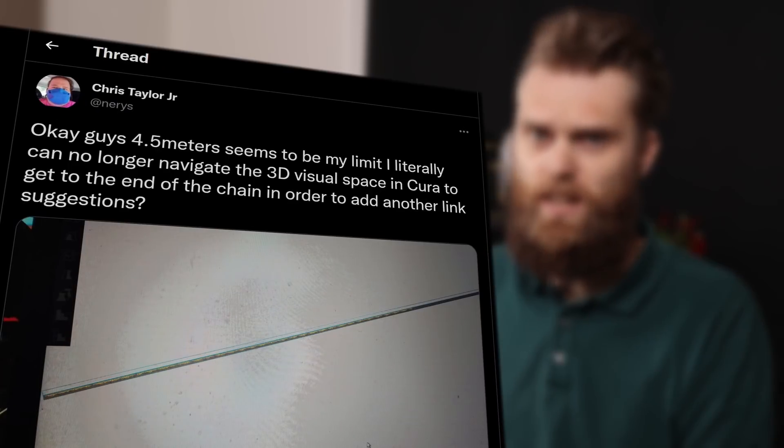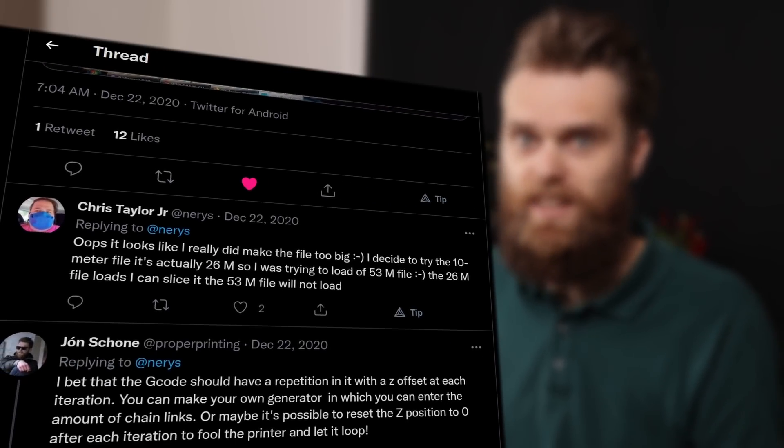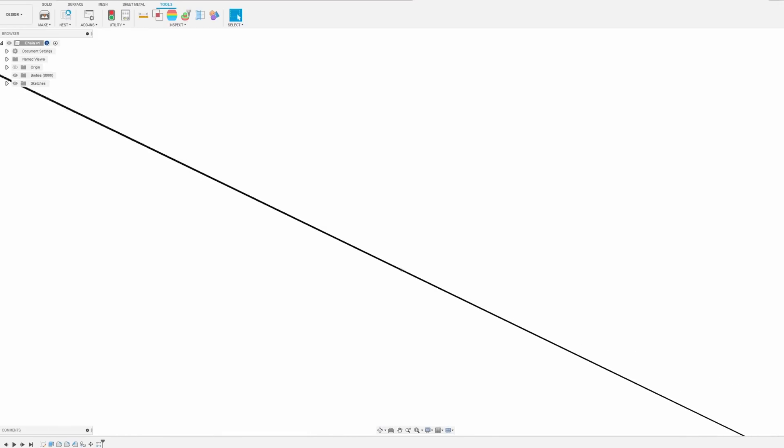On December 22nd, Chris Taylor had this exact problem. He made a file larger than the slicer supported and ended up with a file of 53 megabytes. 53 megabytes of commands in plain text is a lot of commands. In order to print infinitely large, there must be some kind of recurring sequence in there, so I replied to that saying the gcode itself must have some repetition — you must find the pattern within the file itself.